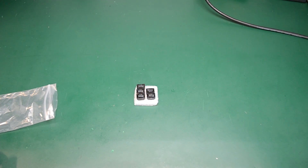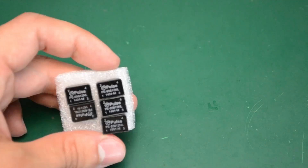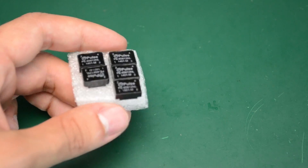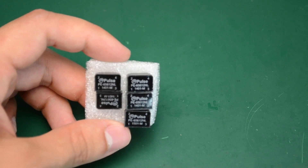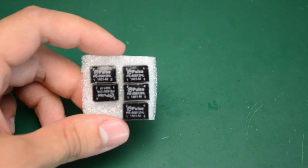This is a set of five isolation transformers. These are 1-to-1 ratio transformers designed specifically for audio applications. Isolation transformers are essential in reducing common mode noise and EMI. I plan on using these in my Bluetooth speaker circuit, although I haven't done any tests yet so I'm not sure if they're entirely needed. I got these from eBay for $2.80 for the set of five. They seem to be Pulse brand but I'm not sure if these are genuine or copies from the Chinese market, though that shouldn't matter much for a passive component like a transformer.